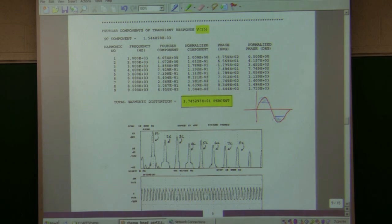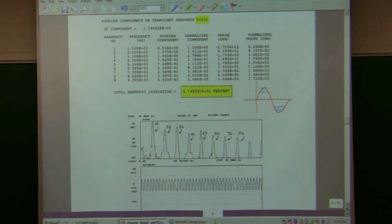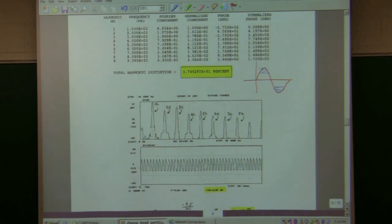And for those that had maybe 202 or are about to get to this probably shortly, this looks more like a square wave. And a square wave has just odd harmonics. So it has the fundamental, and then 3, 5, 7, 9, and so on down the line. And you're getting higher frequency tones that are actually pretty large, and so it sounds higher pitched or more treble when you clip it.